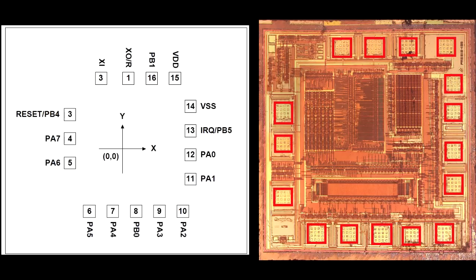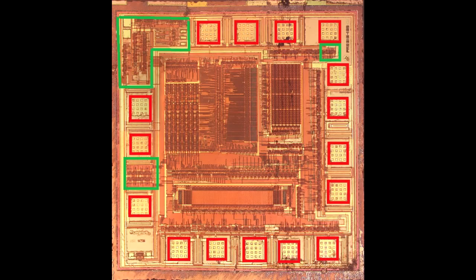This particular die or an earlier version of it seems to match the SPMC01A. Unusually, normally you only see I/O pads in the I/O ring on the outside of a silicon die, but here you can see logic creeping into that area. That's because they don't have many I/O pads and they're trying to balance the I/O ring with the actual logic to maximize their die area.